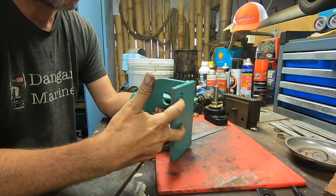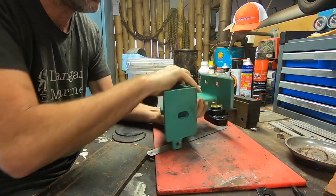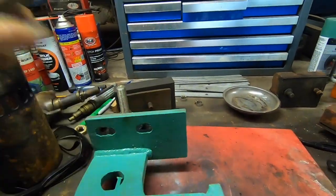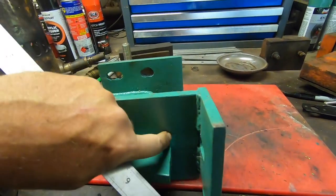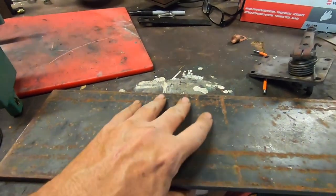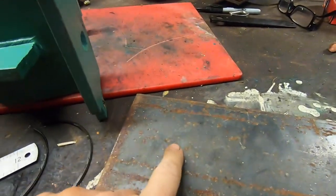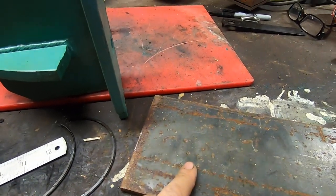There are two main ways to achieve this. One is to drill a second set of holes further down so I can just lift the whole bracket up. The other is to cut 40mm off the bottom and weld it back on. Because of where these holes are and how close to the edge we would get, and the fact that this gap here is exactly 40mm, I'm going to cut the steel here and weld a new base on. I'm going to use a new piece of steel, same thickness, about 10mm thick. We then have to drill a good 18-20mm hole in here - a bit of a challenge, but doable.